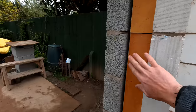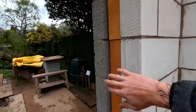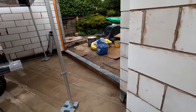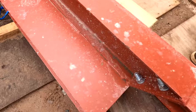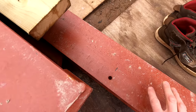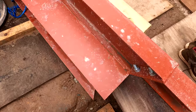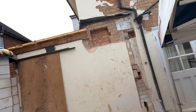I've also just collected the cavity closers — we're going to get those in because the insulation doesn't like getting wet, so we need to make sure this is fully protected. We're protected across the top but you are going to get a small amount hitting the side surface, so Joe's going to crack on with getting all these cavity closers on. I've also gone and got the timber which is going to act as a wall plate on top of our steels — it's going to be bolted on, we've got the holes pre-drilled in the steels in anticipation. I've got some six inch timber that's slightly wider than the steel, so I'm just going to trim that down to suit, machine it up, and then get that bolted on when the steels are in situ.